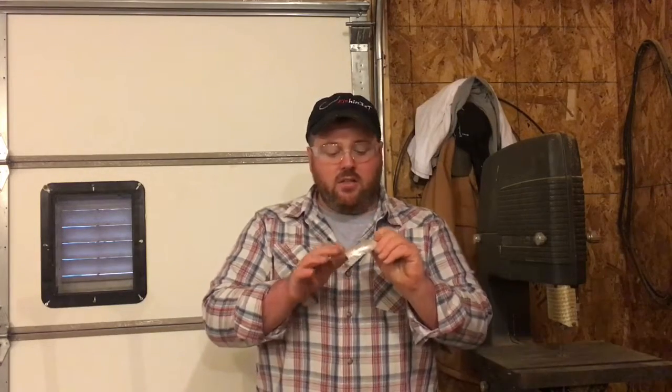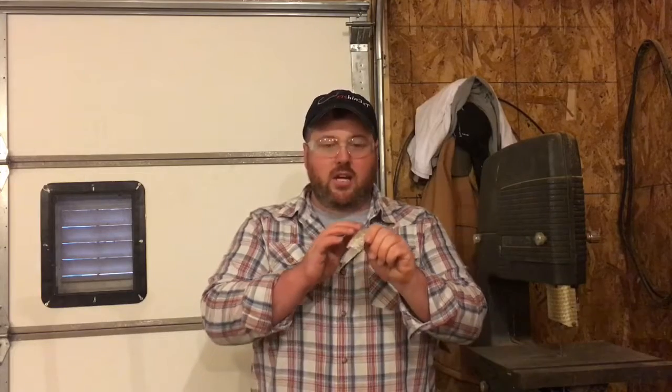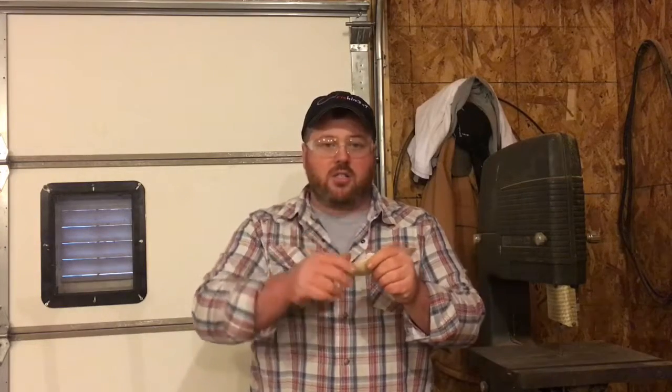When you want to get done and finished, what I did was I sanded this top coat off — you'll get like a black outer skin. Just sand it, wet sand it down. I think it was a 200 grit, and then a 2000 to kind of polish and smooth it up a little. And once I'm done I'll polish it and sand it down.